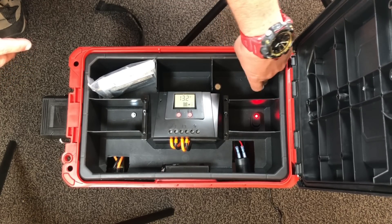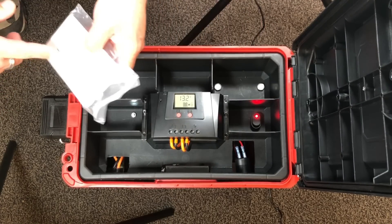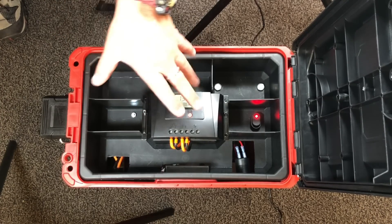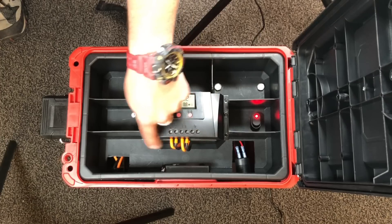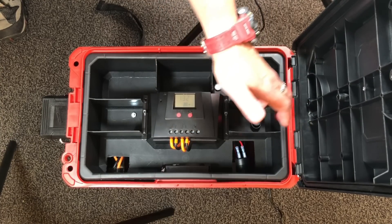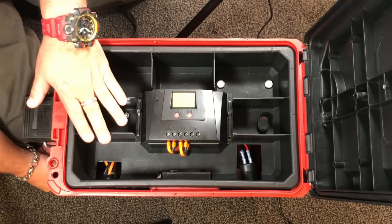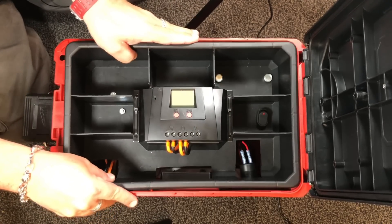Here you can see two bolts — that is the shunt that all the ground goes to. Here's the packet of info I include with all the battery boxes I build: it has instructions for the battery and the charge controller. I actually mounted the fuse box underneath this drop-in as well, which is what those two bolts are for. The wiring in here is all 12 gauge silicone jacketed BNTech Go wire from Amazon — about 30 bucks for a roll of black and red that are 25 feet long each. I've really been happy with that wire. Let's take a look underneath the hood now — you do have to do a little bit more surgery on this; I had to cut out for the outlets and the meter.